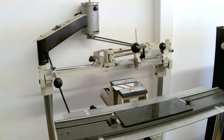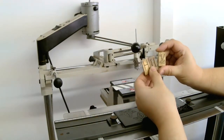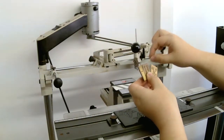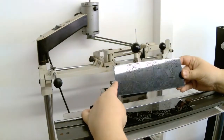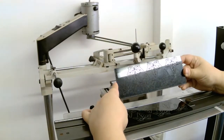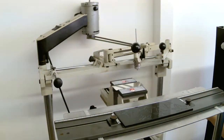So what you'd usually do is you get these sort of oversized letters in brass, and the pantograph would engrave them much smaller than that size on the actual metal that you wanted. What I've done is I have made my own template designs, which are ivy leaves. Got them laser engraved, so I can engrave these ivy leaves onto any metal I like, at any size pretty much.